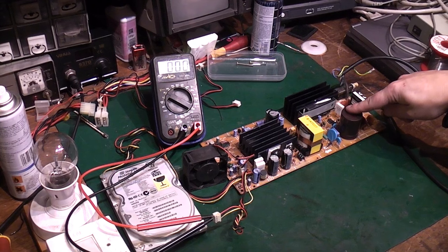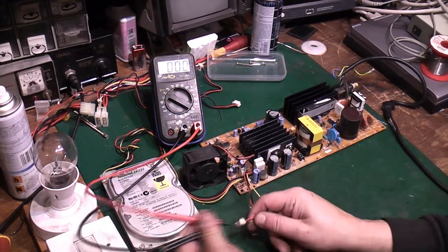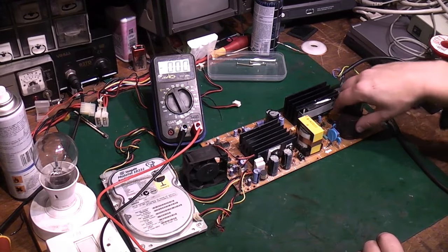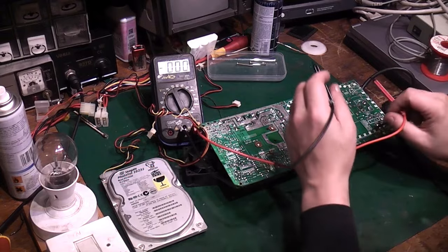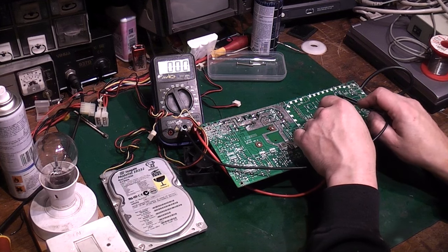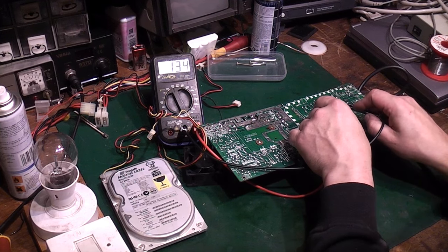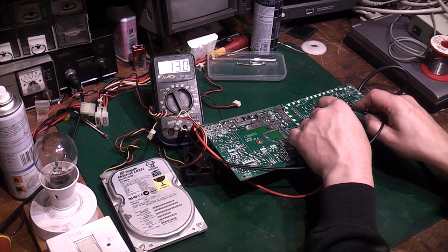Let me just see what voltage we've got on there. Hopefully those are nice big bleed resistors and that's bled off, but let's disconnect that from there. We are switched off there. Let's go right up onto the 500 volts range. I will very carefully turn this board over and we'll just see if we've got anything on that capacitor before we go any further. And that's bled away to nothing. So we've got a good bleed resistor. Hang on, we've got 100 and there's still some voltage there. Yeah, we've got about 130 volts on that.